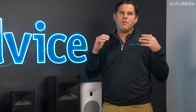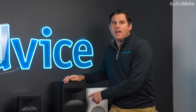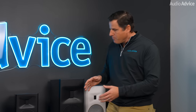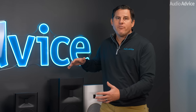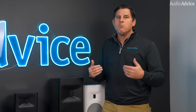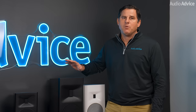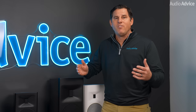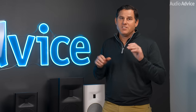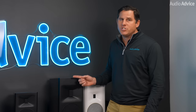All those are characteristics you definitely want in a tweeter. With many living spaces today becoming more open concept, Martin Logan wanted to extract just a little more dispersion from this great tweeter. To do this, they've added a waveguide on the front of the speaker cabinet. This improved both horizontal and vertical dispersion by 10 degrees, and actually 15 degrees vertically on the XT series, giving it more linearity and a wider range of listening positions. This design also simultaneously allowed them more freedom in getting the response even flatter. All of the new Motion models have this new Gen 2 Obsidian Folded Motion tweeter, with the XT series getting a bigger version of the same tech.